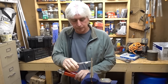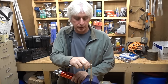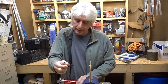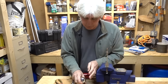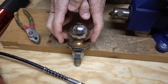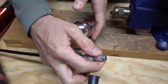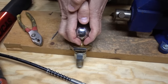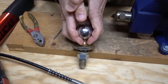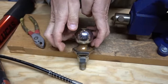So it's a simple little procedure but it works. I'm going to show you a closeup of how this end works. Basically, you see this ball hitch right here — this is the same as that greaser. As you crank this around and clamp it down, it's pushing those metal tabs in and they grab that ball and they're stuck on it and they won't come off. Pump your grease in and when you're done, loosen it back up and they're off of there.